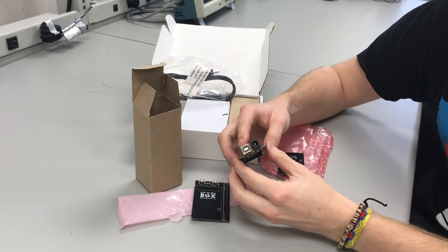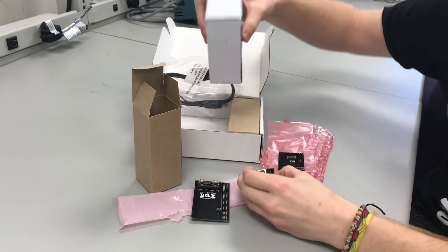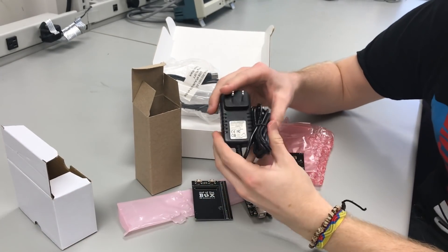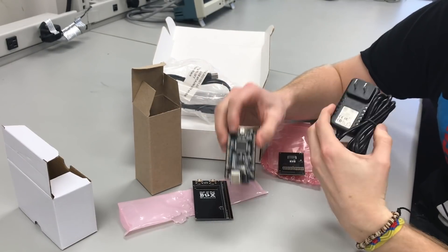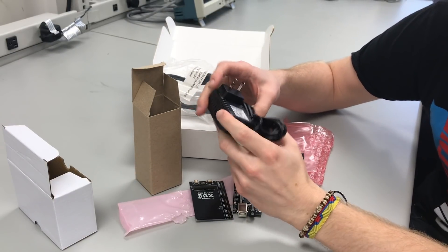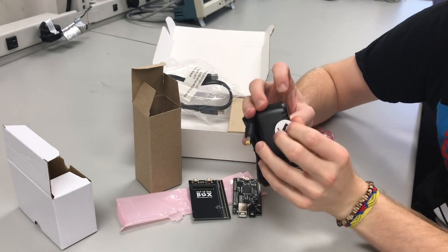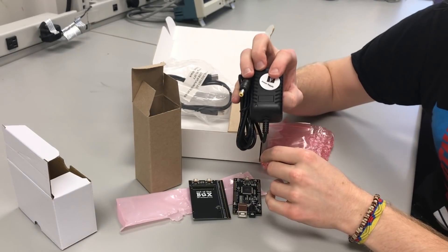There's also a DC 5-volt jack for a DC 5-volt power adapter included in the white box. It is necessary that everybody with this kit use this exact DC 5-volt power adapter for powering this board — otherwise it might draw too much current and fry your board. This will be used to power two of the accessory boards. Additionally, there's a sticker given in lab to identify this power adapter, and it's recommended you place that on the adapter.